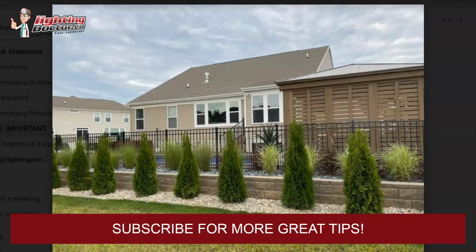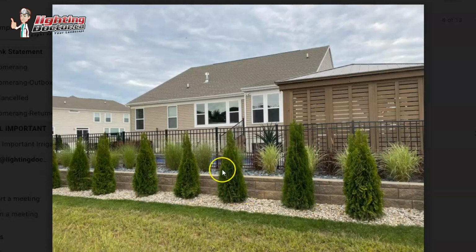So that might be an area where, say you've got this shrub lit up from this side with a path and garden light, or sorry, with a wash light, then what I might try and do is put a wash light here that's going to highlight these a little bit. It's going to highlight the retaining wall, and it's going to cast a little bit of light onto those grasses as well. And if you can stagger the wash lights on this side, say maybe 4 of them there, and the other 4 on this side shining this way, you're still going to get a bit of an effect from the pool area, but it's also going to make your neighbors a little bit jealous because it's going to stand out a little bit more.